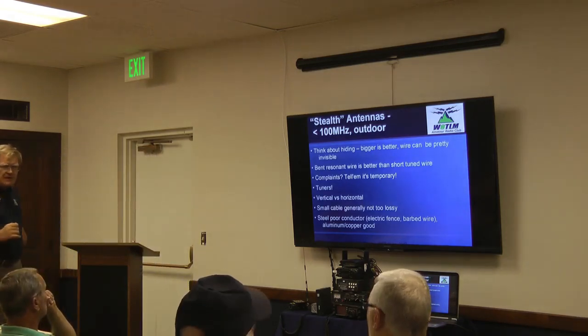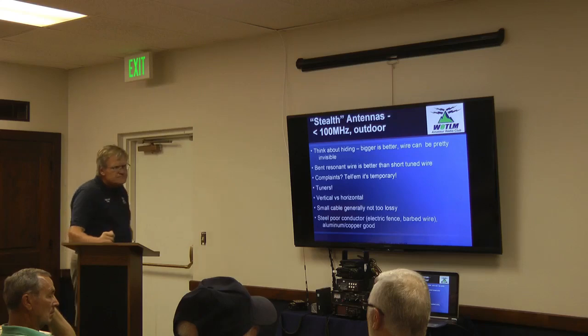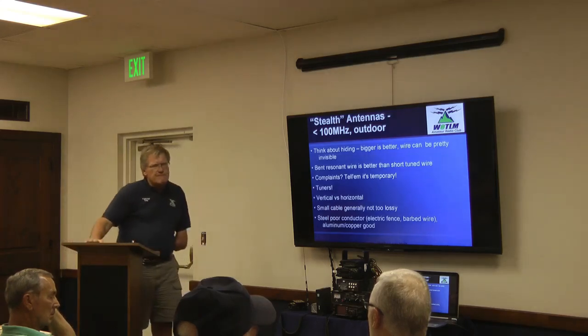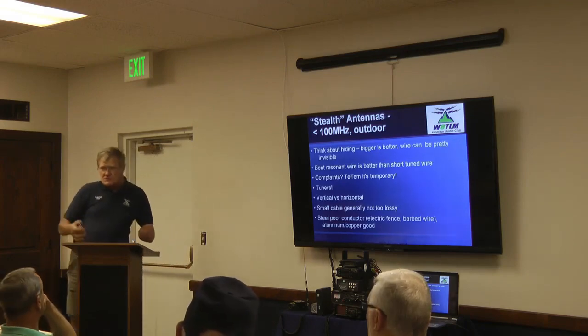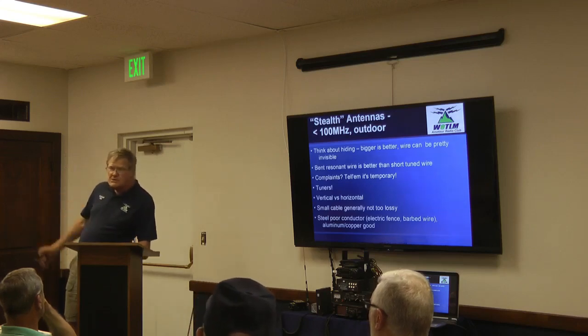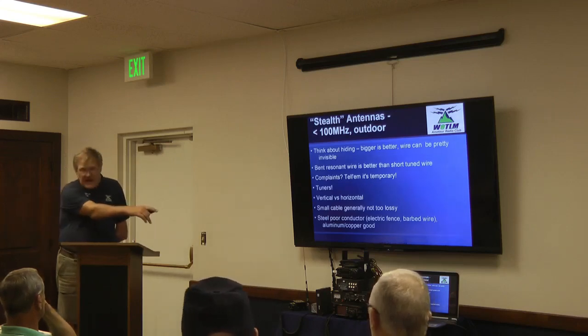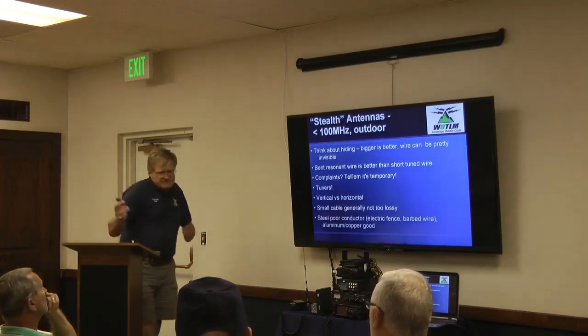Mike, do you have any comments on that? Yeah, I think it depends on the size of the antenna. If you have a really long run of steel, yeah, it's going to be lossy. But it depends on the amount of loss. Yeah. And again, I've used a barbed wire length for a long wire HF antenna, and this 929 tuned the damn thing, and I talked to Mexico. You know?